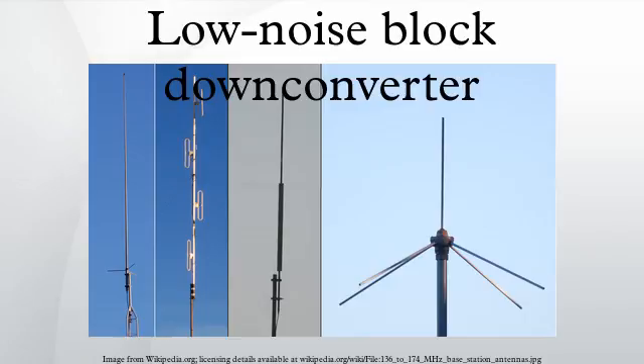The LNB is usually a small box suspended on one or more short booms, or feed arms, in front of the dish reflector at its focus. The microwave signal from the dish is picked up by a feed horn on the LNB and is fed to a section of waveguide. One or more metal pins, or probes, protrude into the waveguide at right angles to the axis and act as antennas, feeding the signal to a PCB inside the LNB's shielded box for processing. The lower frequency IF output signal emerges from a socket on the box to which the coaxial cable connects.